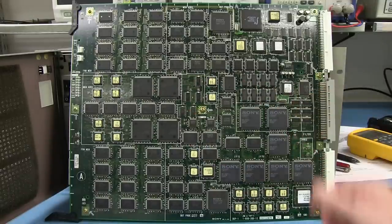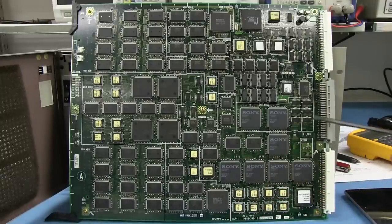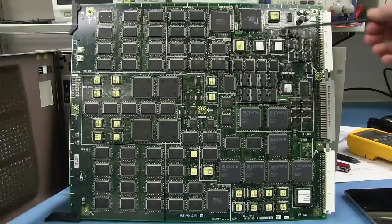Common? What does that mean? I got no idea. Output processing. And we've got some filter. Oh, look, a 3-volt regulator down here. Wow, geez, I thought all this was just 5-volt over the whole system, but I wonder what they need the 3-volt for. And is it 3 or is it 3.3? I don't know. Interesting, but there you go. And then you've got some processing, more circuitry up here marked common, and then big 10 amps. They need a lot of grunt on this board.